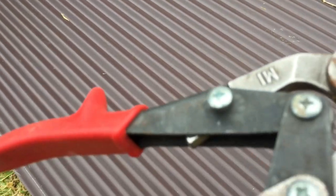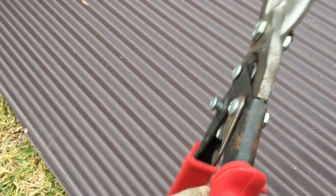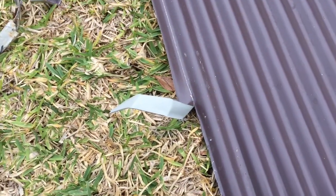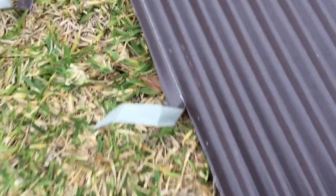I'm using this brand. If you're going to go and buy tin snips, buy decent ones — there's nothing like shoddy tin snips. This type curls the steel as it cuts it. There are flat tin snips but they won't give you a good edge. With the right snips you'll end up with a straight edge right on your scribe line.